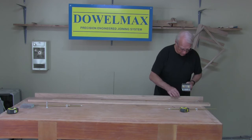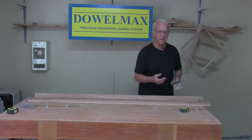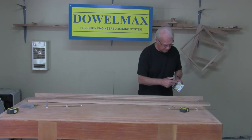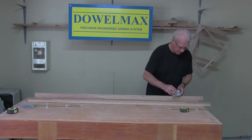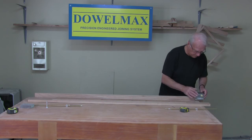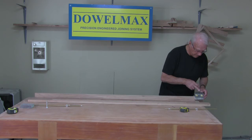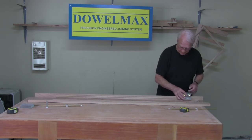Now, the wood thickness is 7/8, so half of that is 7/16, less 3/8 is a 16th, where we install a 16th washer in between the reference bracket and the reference block. And we slide it up to the end and reference it perfectly. Be very careful with this measurement because we're doing the same on both ends. And drill 1, 2 and 3. This rail is 2 1/8 in width, so therefore we can get 3 dowels perfectly equidistant in there.